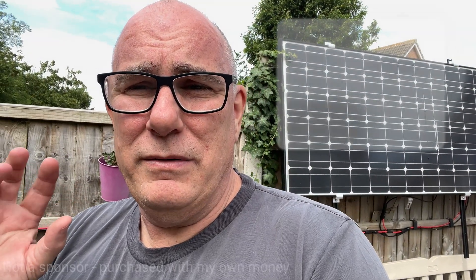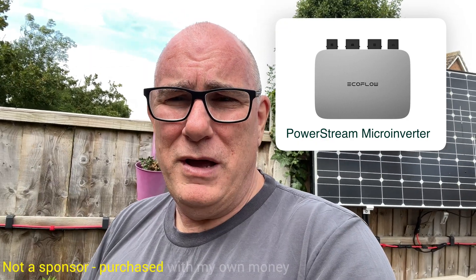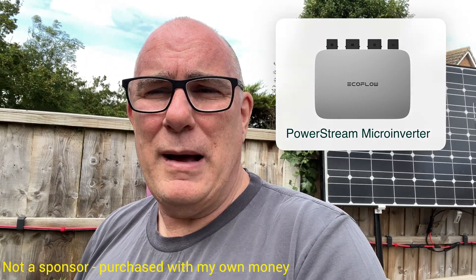So somewhere between east and southeast. They then run into a micro-inverter from a company called EcoFlow. This inverter can handle up to a maximum of 800 watts. We've got approximately 800 watts of panels configured in two strings. The strings are in parallel with each other just to keep the voltage level down — if you want to know more about that, check out my previous video. They then run into a series of batteries — we've got about seven kilowatts of batteries attached, so we can capture and store just about everything these panels are producing.